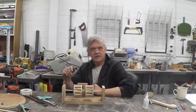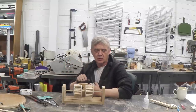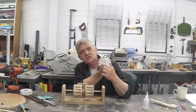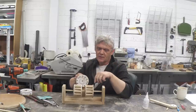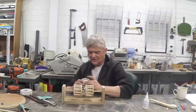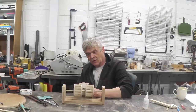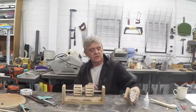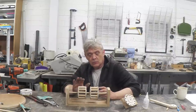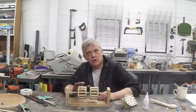There are the cage gears mounted in a little frame so we can spin them. If I put a cog here and turn it, I'll be turning the input 90 degrees to give output on that shaft. You'll notice I've drilled holes all the way around but only put in pegs just less than halfway. If I'd filled it all the way up, I'd just get a single rotation on that shaft. But doing it just less than halfway and rotating clockwise continuously, what it does is reciprocate. I'll fasten it together and give you a close-up so you can see that reciprocation. This can be made out of absolutely anything - sheets of brass and brass bar would do it - just with a drill and a few hole saws.